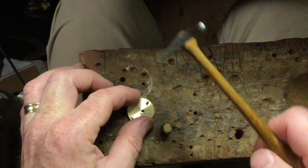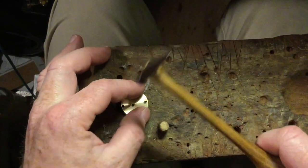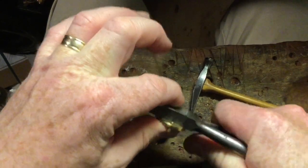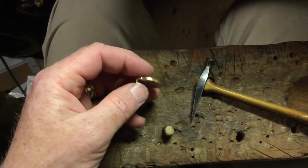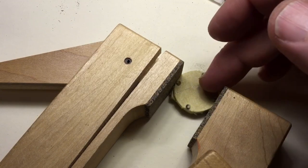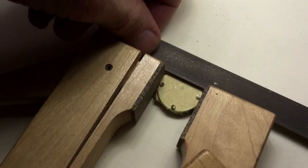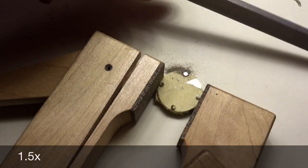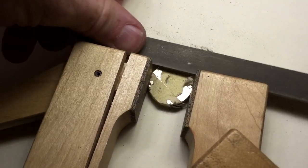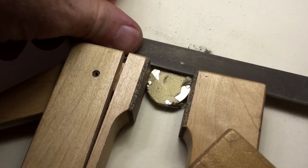Using some holes drilled in a block of wood for clearance, gently tap the legs home one by one before snipping them off close. Make sure you save the leftover pins, as they can be used for other projects. I'm trying a trick I've seen clickspring do — put masking tape over the work to protect it and then file down the excess metal sticking through. I'm not as neat as clickspring, but it did help.